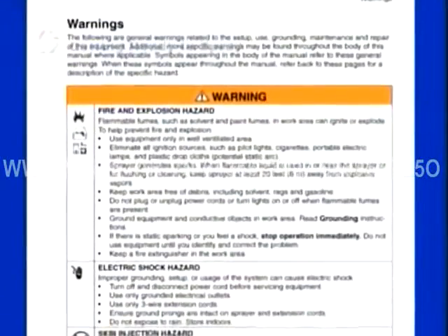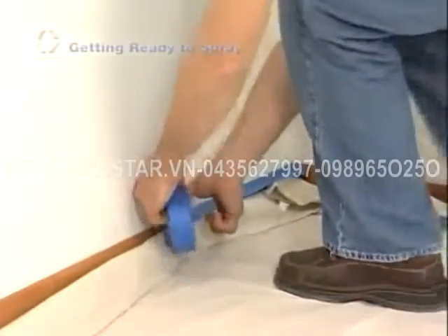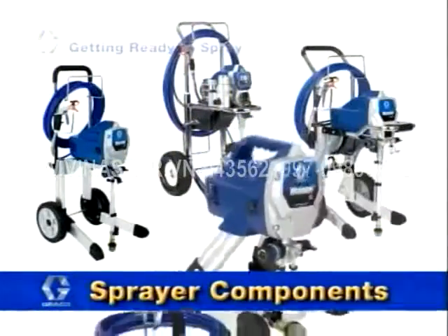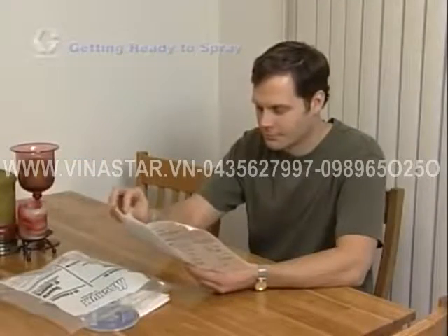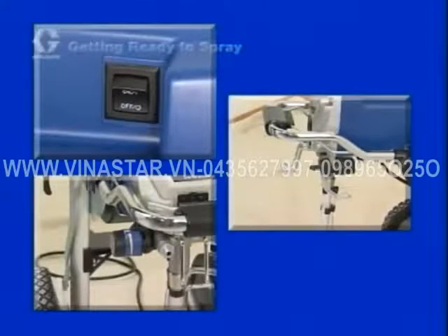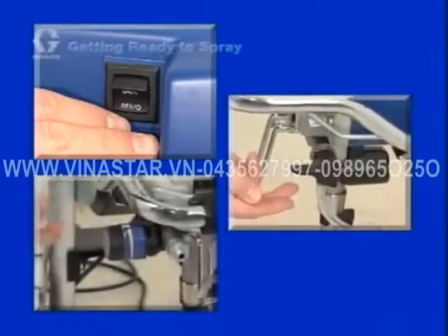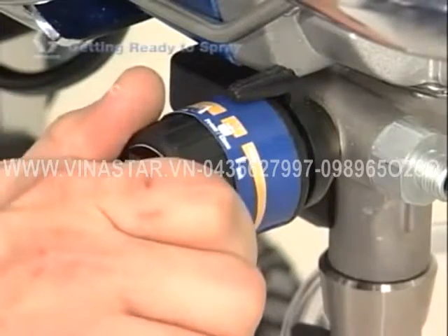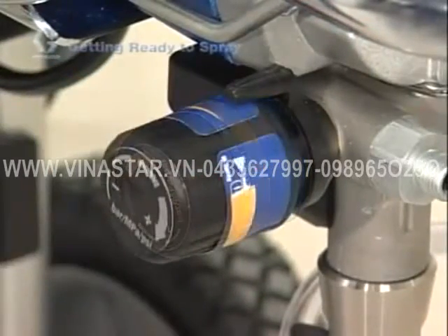With the area prepared for spraying, it is time to get familiar with the sprayer. No matter which Graco sprayer you purchased, the basic components are very similar. Consult your manual for information about operation with advanced features of specific sprayers. Graco sprayers have three separate controls: the on-off power switch, the prime spray valve, and the pressure control knob. The pressure control knob allows you to control the spraying pressure — turn the knob clockwise for more pressure and counter-clockwise for less pressure.